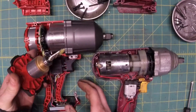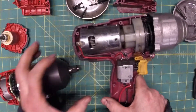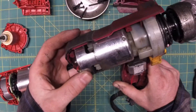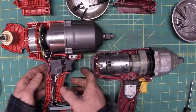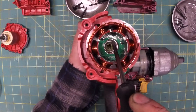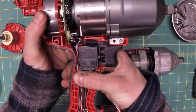Pull this out and you see the key to all the magic: a beautifully made induction drive brushless motor with a little bearing in the front, made in China of course. A brushed DC motor like the Harbor Freight's uses brushes to maintain contact with the commutator bars and keep the current flowing while the rotor spins. It's worked fine for an eternity, but brushes can wear out and these are unserviceable. Pound for pound, it's nowhere near as efficient as an induction drive motor. The Milwaukee's brushless unit has big beefy field windings and a hall effect generator board with three hall effect sensors that detect the rotor as it spins and keep track of its position, so that the control circuit via that ribbon cable can time the pulses perfectly and keep it all running smoothly.